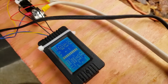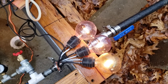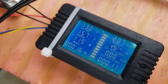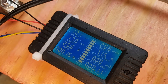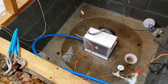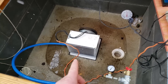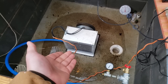There's a spike of watts when I do that, because there's a lot of inertia in the alternator. We're momentarily doing 200 watts. At 11 gallons per minute with the head height I have, that's approximately 550 watts at 100% efficiency. So sadly, right now this is operating at about 20% efficiency.